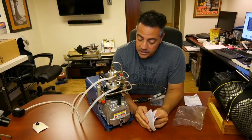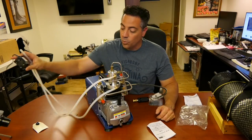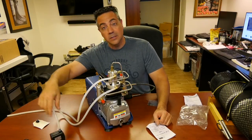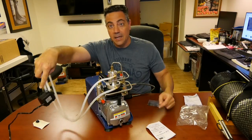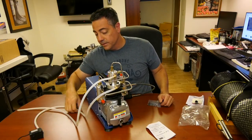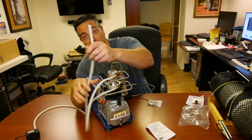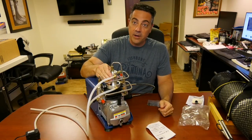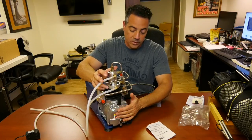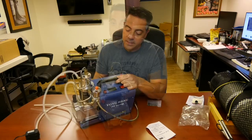There's not too much in the instructions except: don't run this without oil in here, because when they ship it to you, it will not have oil. Very, very important — this product is water-cooled. You will have a water pump. These two parts right here will sit in a bucket of water — you probably want a five-gallon bucket. What happens is this sucks water in through the bottom, passes cold water through the outer part of the piston, and sends the cold water back into the bucket. So this will get very, very hot. Do not touch anything in this upper area. You will burn yourself.